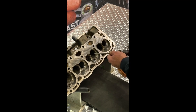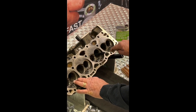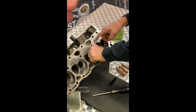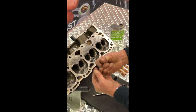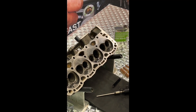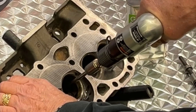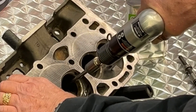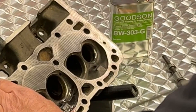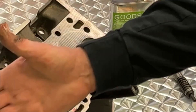I've got my carbide ball set inside, and this is where I want to use a little bit of lubrication. I'm going to add some bronze wall reaming fluid and set my ball back on top of that valve guide bore. You want to have pretty good pressure already on that valve guide sizing ball when you run in, because you don't want the action of the air tool to knock it out of position and have you chasing it through the intake or exhaust port. And it pops right through. So now we've set the clearance on that valve guide bronze liner — rinse and repeat all the way down the boulevard.